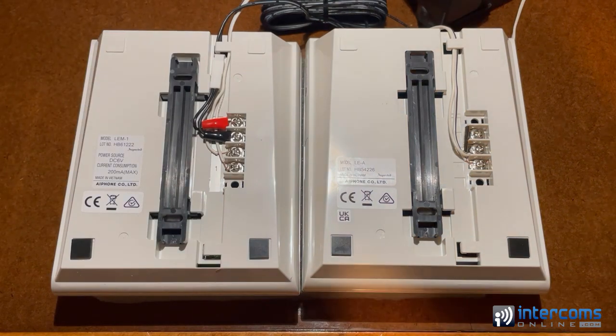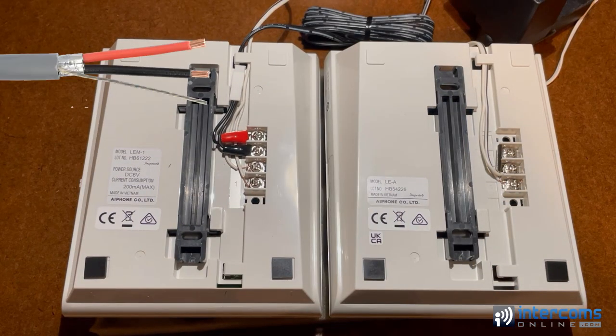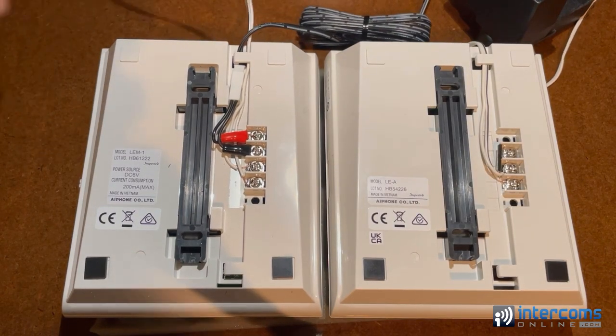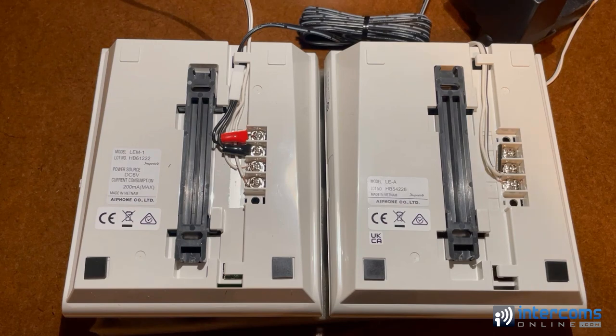The system uses a two-wire shielded cable. Shielded means there's an aluminum wrap around the outside of the two wires, or it could be a copper braid, and what that does is isolate the cable from noise — so if you run it near an electrical power supply or cable running in parallel, the shield will block that noise. However, if you're running a short distance, a simple two-wire cable should be sufficient as long as you don't get any buzzing on the speaker and you're not running it near electrical wiring.